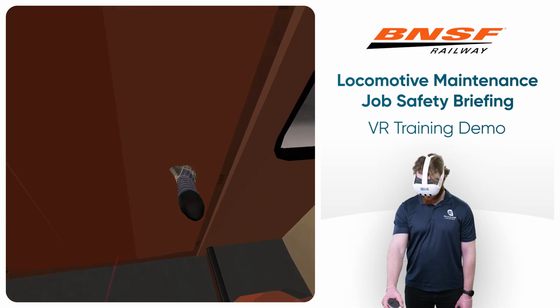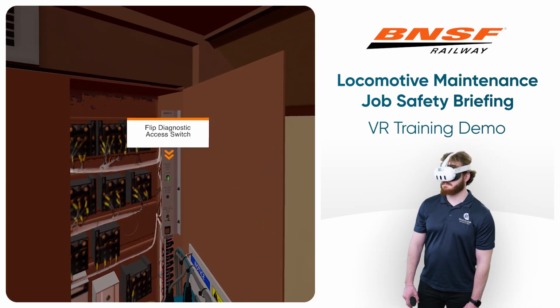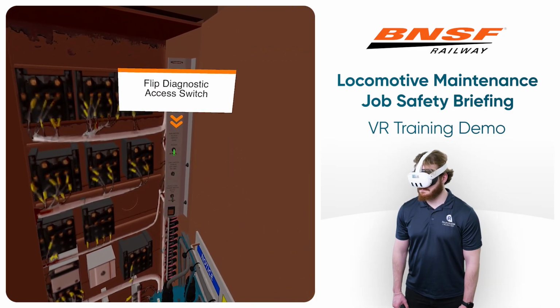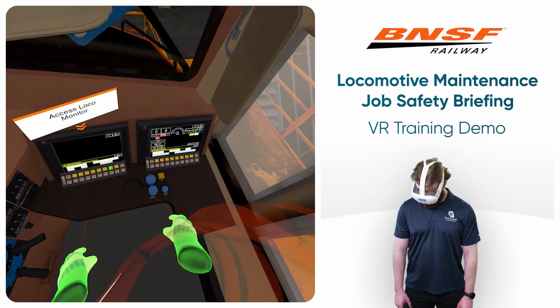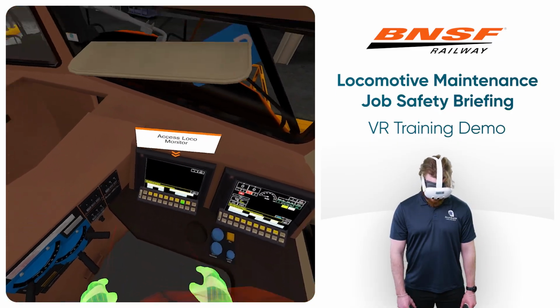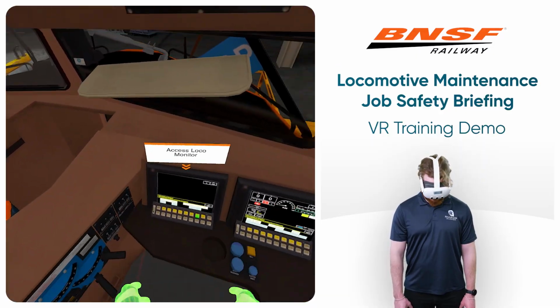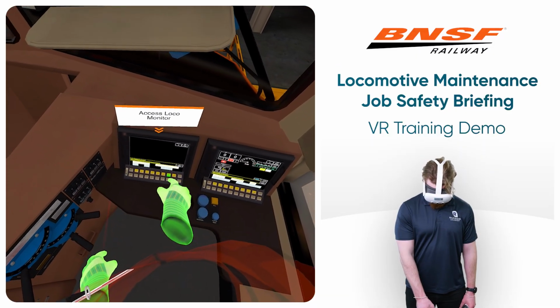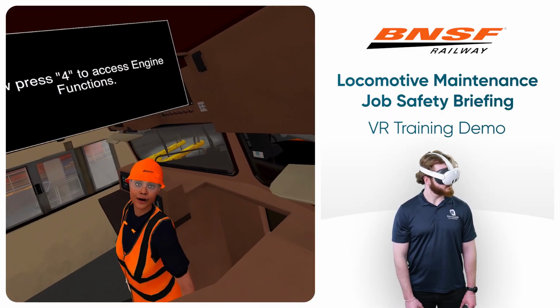Now open the rear cab wall doors. In the top right of the compartment, flip the spring-centered Diagnostic access switch. Now we'll go back to the SDIS screens. The SDIS screens indicate that we now have Level 2 access. At this point, press F7 on the left-hand screen to access the Loco Monitor option. Now press 4 to access engine functions.